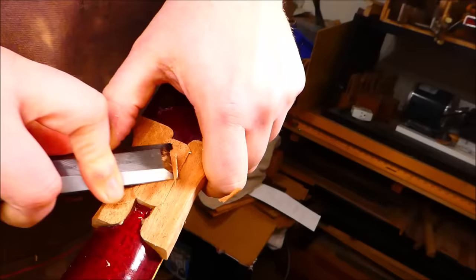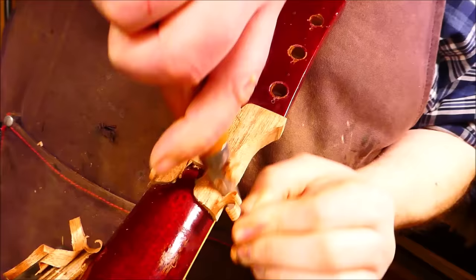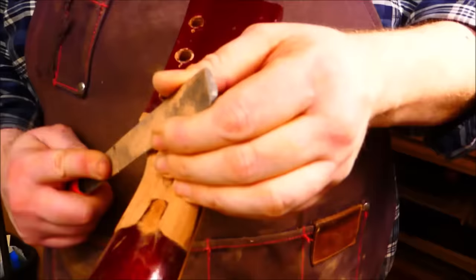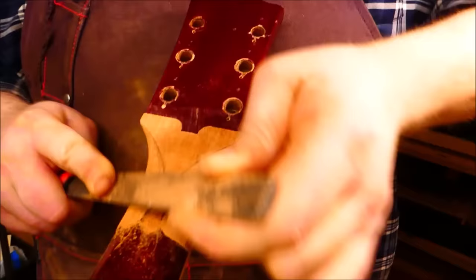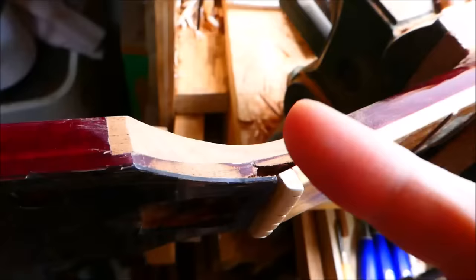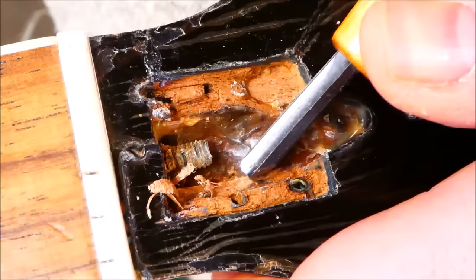Carving is simply a process of taking away anything that doesn't look like a suspiciously muscular Renaissance woman. I use a collection of chisels and Swedish-style carving knives. It looks fun and relaxing, but you've got to be thinking and feeling all the time, recognizing which way the grain is running and changing your angle of attack. Eventually I get to the point where I'm using a file to blend in the surfaces. The goal is to produce something smooth and regular that transitions into what's already there. There's still a big void of missing wood under the nut, and I'll make up a plug for that.